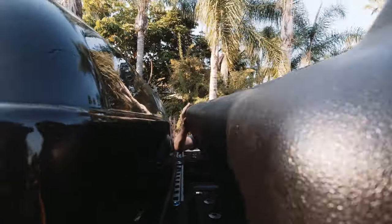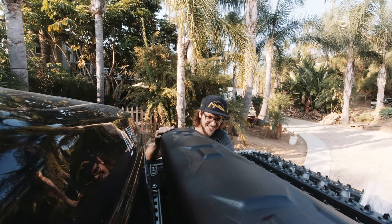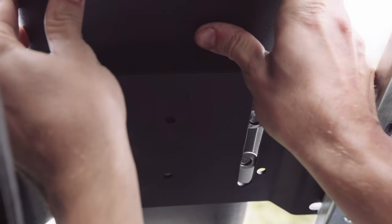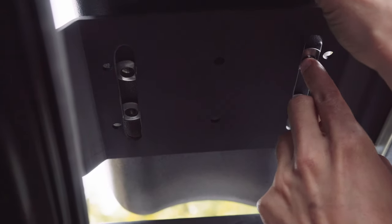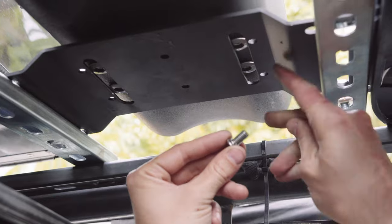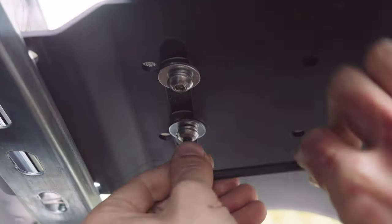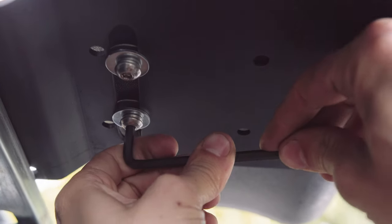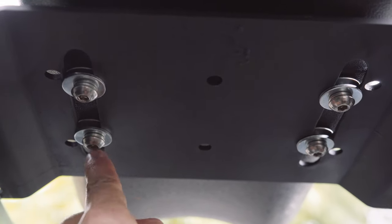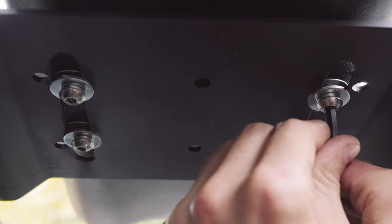Help me, cameraman. Now we'll go inside, center this up, and get those washers in the right place. Now grab your lock washer and washer. This side is all tightened up. It's important to note that after pressurizing the tank, you will want to double-check these again — make sure they're still tight. In some of our testing, they loosened up after the tank pressurized.